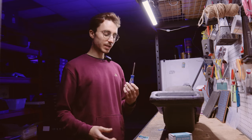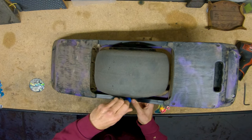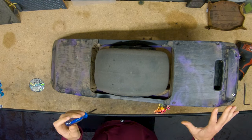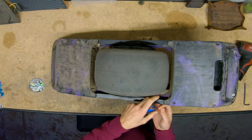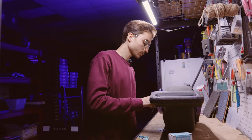The first thing you're going to want to do is take a screwdriver and remove the little screws that protect the wires on your existing axle blocks. If you have stock rails you're also going to want to remove the three little screws that hold the wires to the rails. Once you've got the screws off, just remove the little covers.